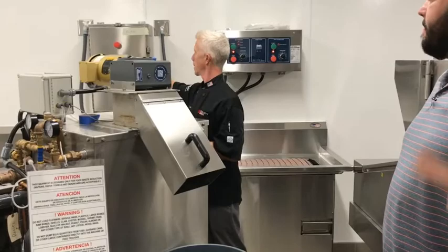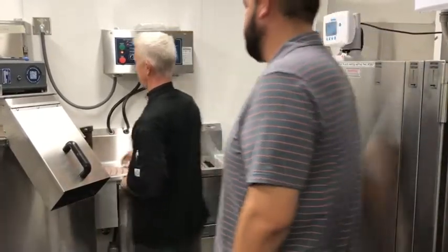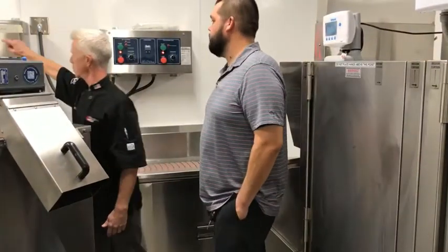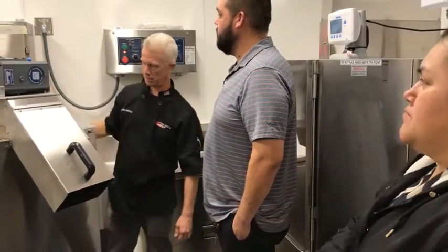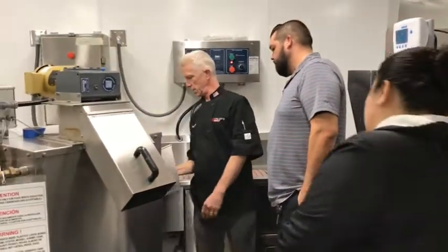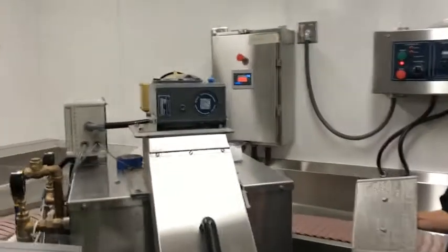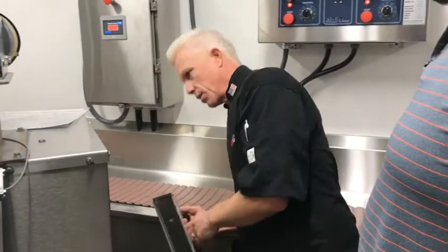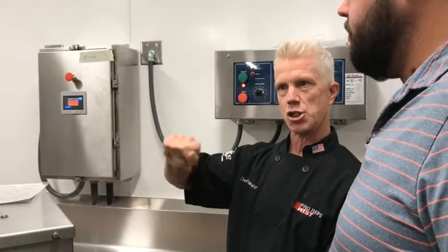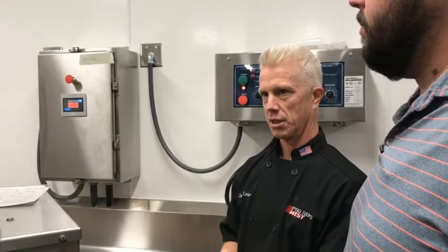So we're never allowed to clean the inside of it? What's that? Maintenance on the inside. Yeah, yeah. So I'll show you, let me turn it off. That's just the red button here, it's a stop. Okay, and then you look in here, you can get that real hose over here, I think it'll go that far. You want to rinse it out, and there's a screen in there. And you just kind of want to get a nylon brush, and just knock off the big bits in there. And then just hose it out.